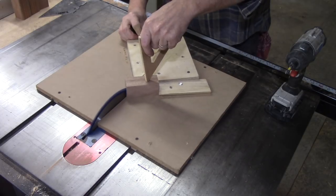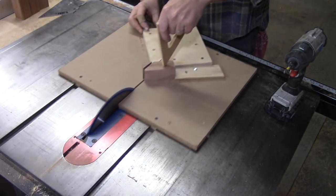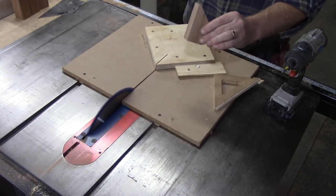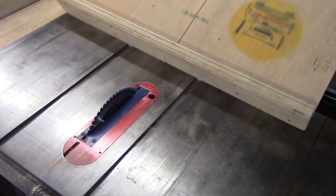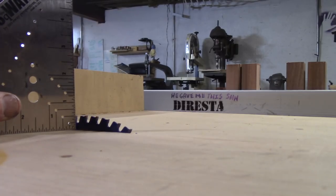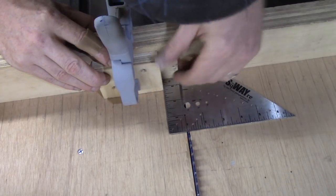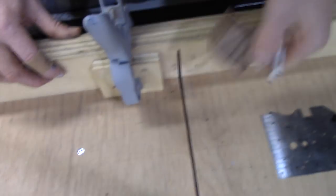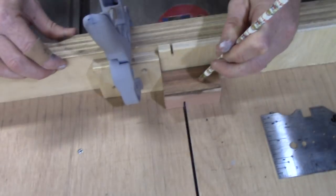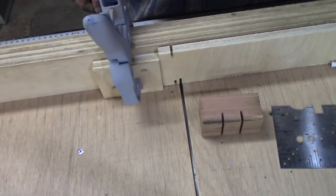This is another simple mitering sled set to 45 degrees. I just slice 45 degrees off the top of the bishop — I didn't quite go all the way, I left a little bit of flat up top just so it wouldn't be pointy. Now back to my other sled. The more complicated one is the knights. Using my stop and a backer board to help prevent tear out, I just divided the thirds of the block and then simply cleaned them all up.